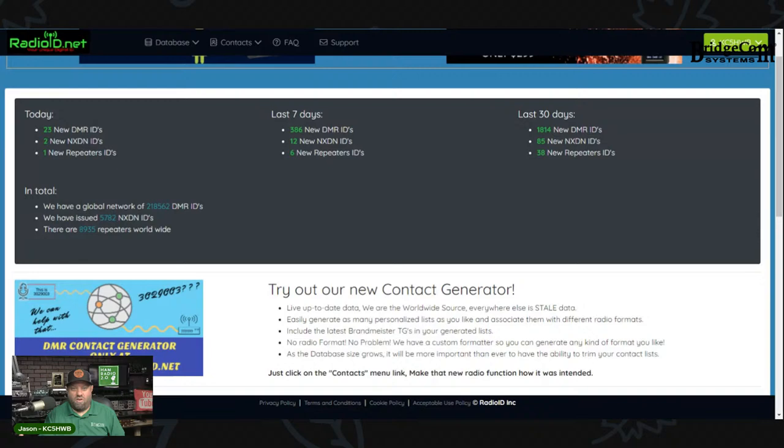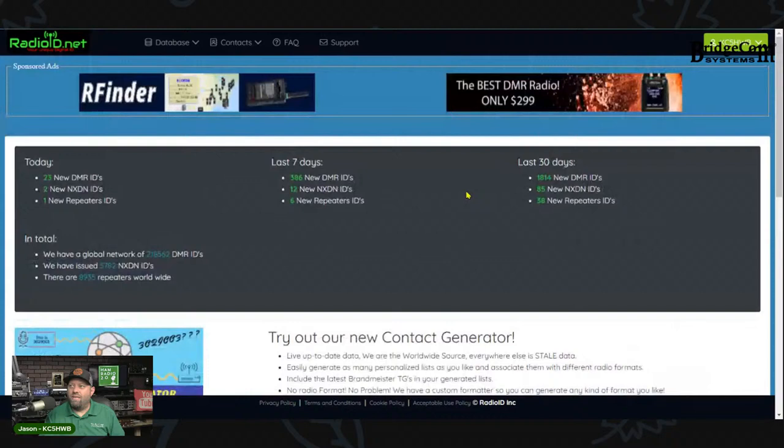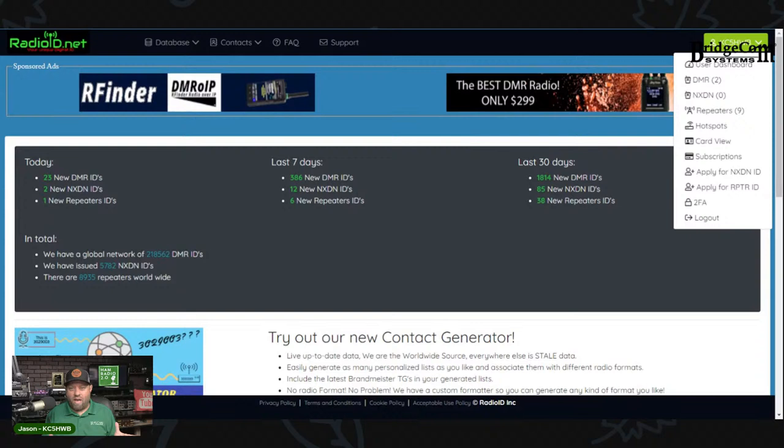This is where you would go, radioid.net. You can create an account. And I should have said this up front: this is all free. It doesn't cost you anything. You don't have to pay for an ID, a repeater ID, or a subscriber ID for yourself. You need a 7-digit subscriber ID for yourself, and generally when you apply, they give you 2. The thinking was that you would use 1 in your HT and 1 in your mobile radio. You don't have to do it that way. That's just how it started, and it's kept that way ever since day one.